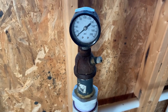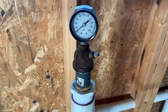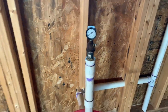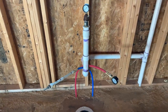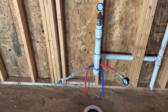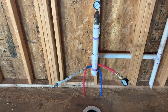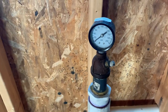Back to show you how to pressure test your plumbing system. After you rough in your drain lines and pressure lines, you'll want to do some kind of test. Some people do water tests, some people do air tests — we typically just do the air test. It's a little easier to do and just as effective in my opinion, if not more effective.